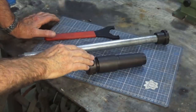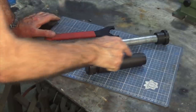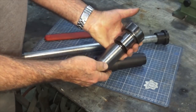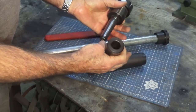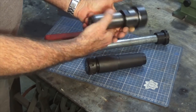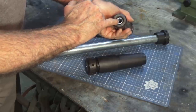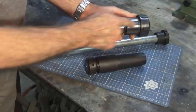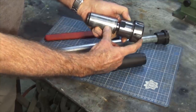So let's go and have a look. The first of these tools is an ER32 collet chuck that's designed to go in the spindle of my Colchester lathe. Now Colchester has a number five Morse taper in the spindle. You might say, I want to just go and get a normal collet chuck like this one here — this is an ER40 with a number three Morse taper, and that's an adapter that goes from number three to number five. I've used that in the lathe before and it does a good job. The only problem is that it takes a draw bar, and when the draw bar is inserted in this end of the collet chuck, it means you can't pass long stock through the centre of the chuck itself, so you're limited to stock that's about that long.